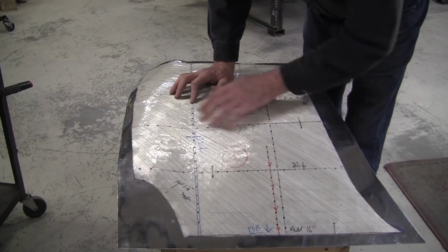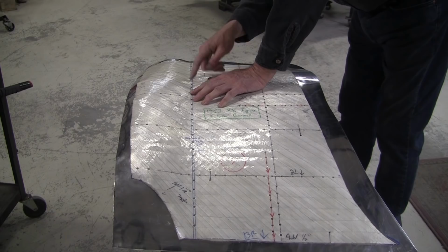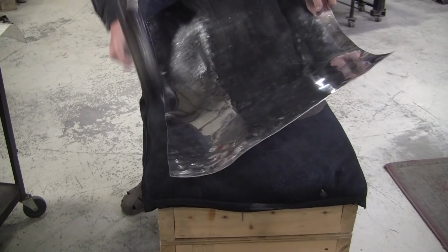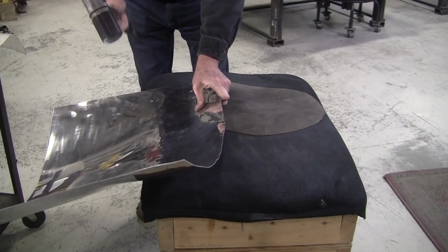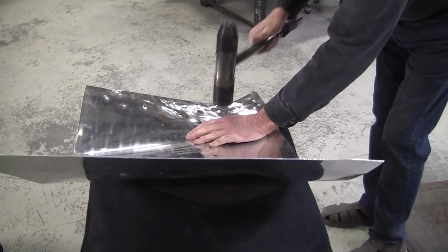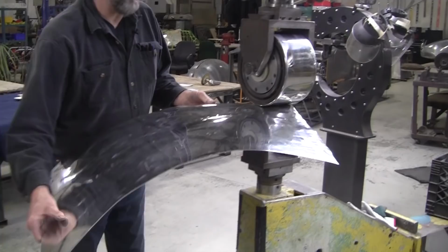I got a little bit of looseness showing over here. See, it's a little overdeveloped right in here. I got to pop that edge up a little bit. And it still needs a little right in here, and I'm going to need more here. Again, when I did that, it affected this a little bit. So we'll pop this edge up a little. And then a little more on this valley and back here. Give it a little bit more here too. Alright, I'm going to wheel that out now and see what I got. So the object now is just to planish out all these lumps and bumps.